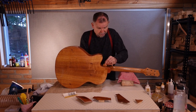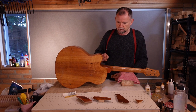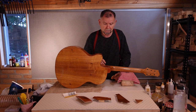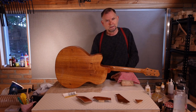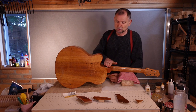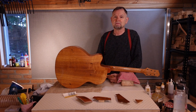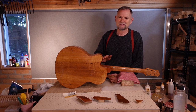One point of interest is this area right here — the heel cutaway transition. We've got three different species of timber in two different grain orientations. Right now, you cannot feel any of those joints. But in a month or so, I will be able to. The solution for that, which we are not going to be doing on this build, is to seal that area, wait a couple of months, then sand it again before finishing. Otherwise, we just have to live with it. It's still beautiful.